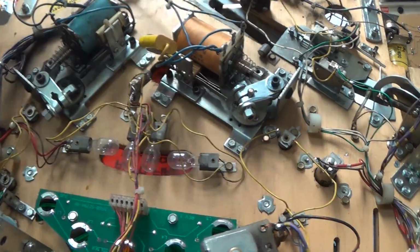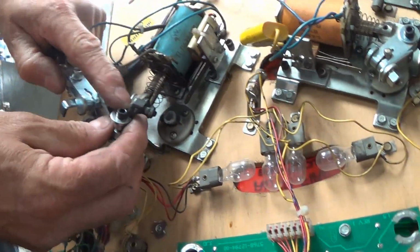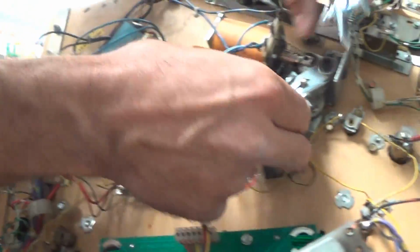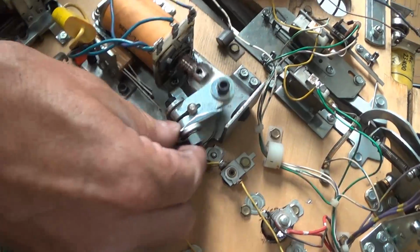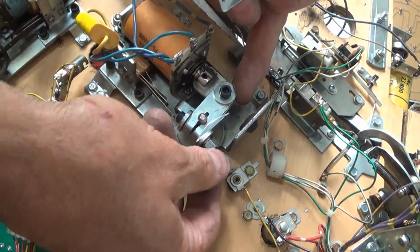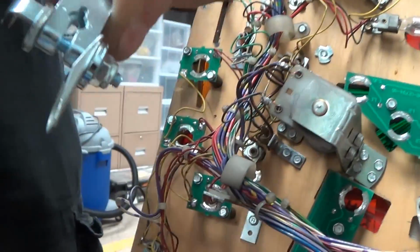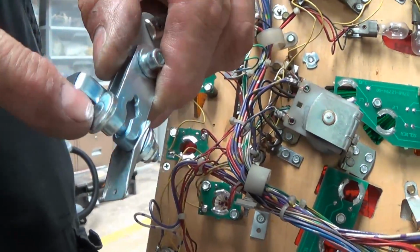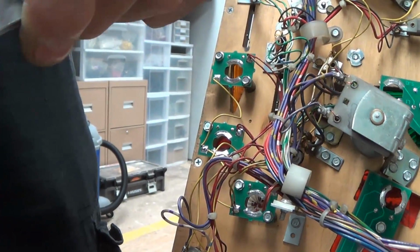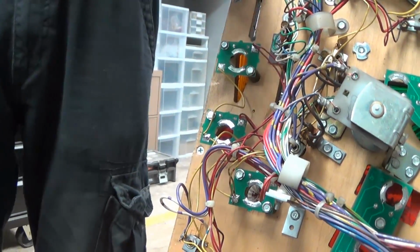What they've done, though, aside from that, is they've got away from having to need the Allen wrench to hold this end, which is very hard when the thing's together because you can see you can't get to it. You actually have to put it in here. Position your flipper up top, put it in here, and then tighten this up. It's very hard. They did away with that. This is a welded washer onto the end of the shaft, and then you just turn this. That is self-retained with a little cutout there. Nice. So that's an aftermarket new generation improvement.